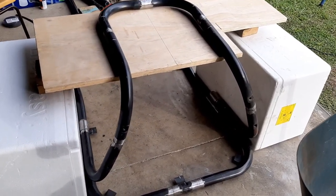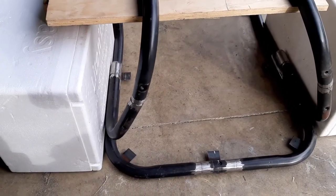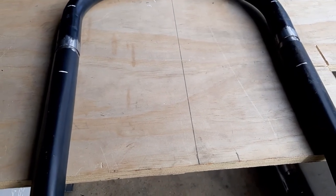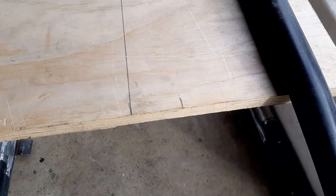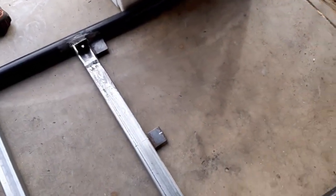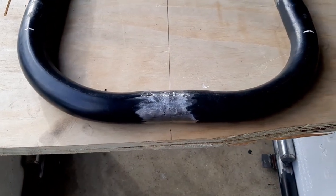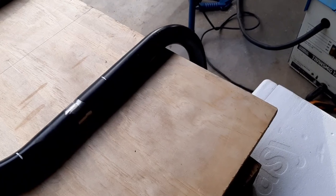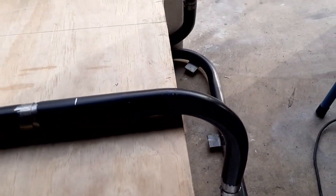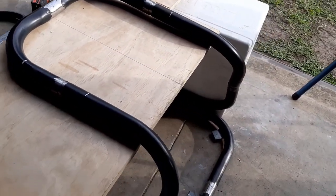She's all sitting where it's got to be. I measured the center of the frame, put white paint on it, used a spirit level to transfer the mark up to the wooden board, then measured between the two tubes to make sure it's in the middle - same on the back frame rail. It's all sitting where it needs to sit. There's a slight angle deviation in the pipes but I've got a smaller tube inside tacked together. Going to tack it and if it measures up, fully weld it.